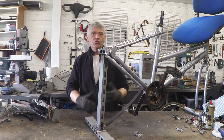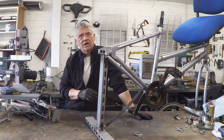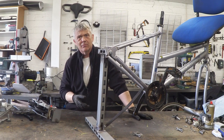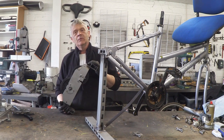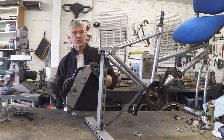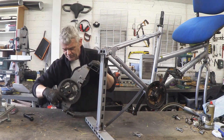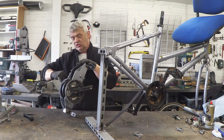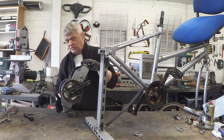Now obviously we need to take our input — which is our legs on this here — to our output. And to do that, we need to up the revolutions, which means we need a gear set. Now if you looked at video 1097 you'll have seen the drawing, and that drawing has a lot of shafts and pulleys and cogs. If you watched video 1085, we used this thing — a chunk out of an exercise bike — to make an electricity generator by gluing some toothed belt onto the flywheel. That already has all those marvellous gear ratios in there. Plus, because it's an exercise bike, it's got this, and I have a spare crankset. So we have a little cog here and a big cog here. We can put a chain between those two, and when we pedal, that output turns like crazy. And because that's a toothed belt, we can put another toothed belt over it to create an output drive. So the whole drive system is contained in one piece.